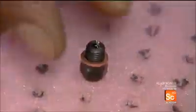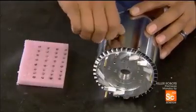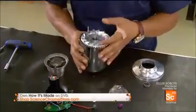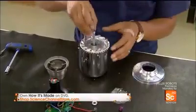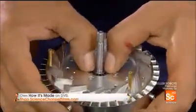And now the glow plug, so named because it glows to ignite the fuel inside. He pops it into a threaded slot on the side of the combustion chamber, which is by now encased in an outer shell. Next, he installs the turbine and shaft, sliding the shaft into the center cylinder. He supports the shaft on both ends with thrust bearings and washers, pressing the parts into place.